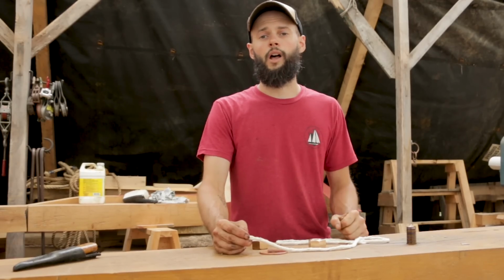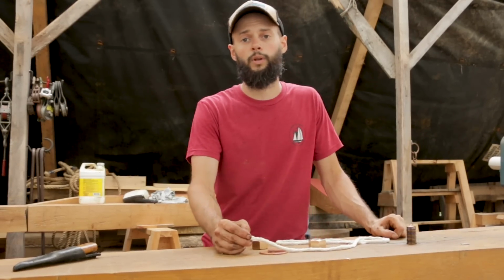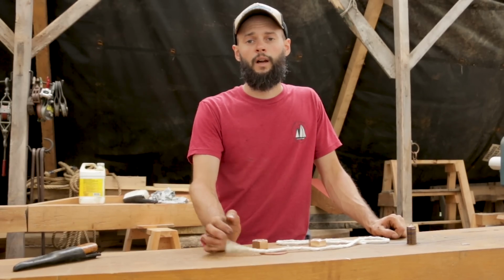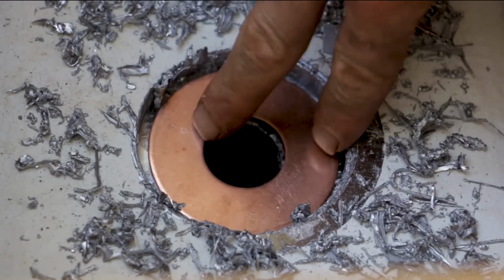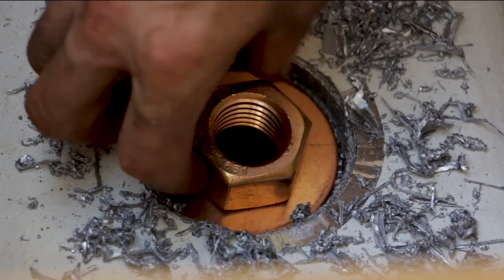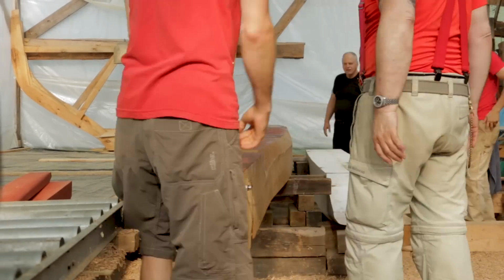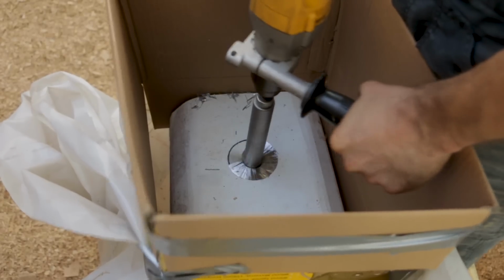And hopefully that'll help keep a lot of water from coming in at the ballast keel and traveling up the keel bolts. So we're going to do that on all the principal backbone fastenings on the outboard edge on the outside of the boat. And yes, we did think of drilling the counterbores at the bottom of the lead keel. A little while ago, we were visited by two awesome Canadians, Charles and René, who helped us flip the keels, and then we used a homemade counterbore bit that Joe made for us.